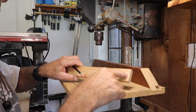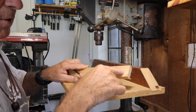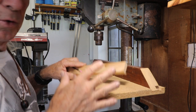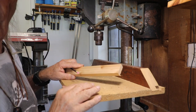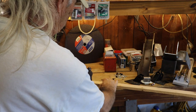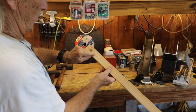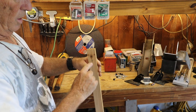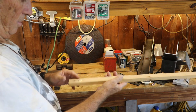I'm going to drill a hole a couple of inches back — about two inches. I'm going to drill a 5/16" hole, and then knock the T-nut into the hole. The T-nut is now smashed into that 5/16" hole, and it's set back behind the lumber — up inside a little bit — which is what I want, because that way when I thread in my screw to attach to this, I can pull everything tight for this little stand we're making.